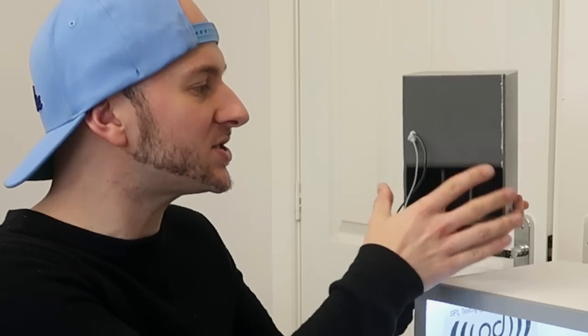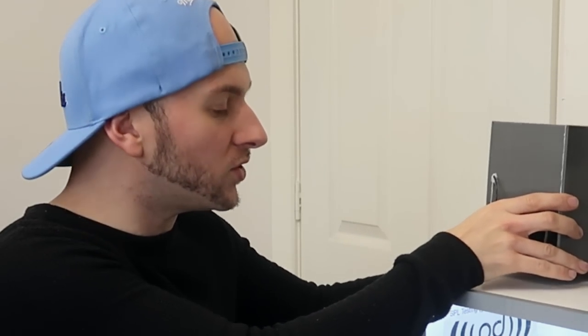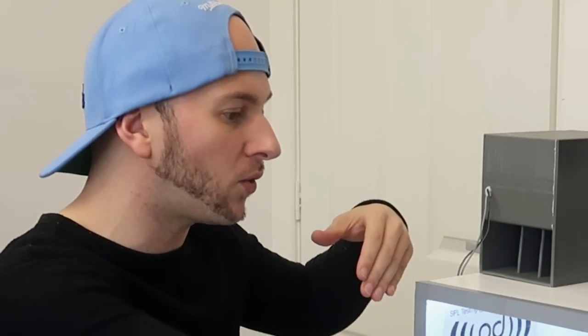Secondly, this enclosure leans on the lower frequency horn loading to get those ridiculous scores down at those lower frequencies. Now, with the door sealed off, we lose the Helmholtz mode of this cabin, therefore relying on only the quarter wave mode of the cabin and also just the performance of the driver and box itself.